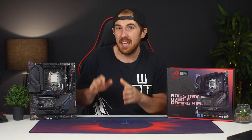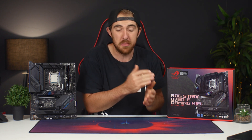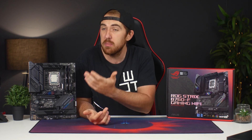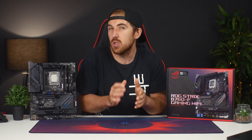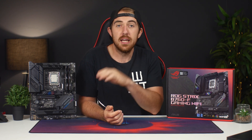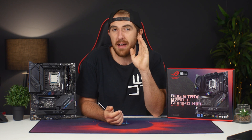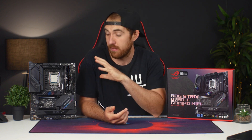So that's pretty much it for my look at the Asus ROG Strix B760F board — a pretty decent board. It is a bit more up there in the price range compared to some of the other B-series boards, but you do have plenty of options. You also have the option of going for the cheaper TUF boards or the Prime boards as well. So far the board delivers everything that you would really need: a decent set of I/O — I would have liked a bit more USBs but it's not the biggest issue — decent VRM temps at 55 degrees peak if the temperature reading was correct, and good enough storage options with three M.2s, all of them being Gen 4, not Gen 5 — but that's fine for more of a budget board.